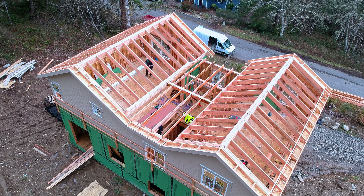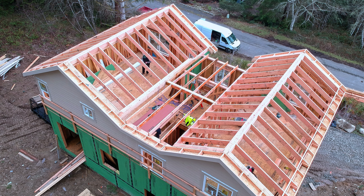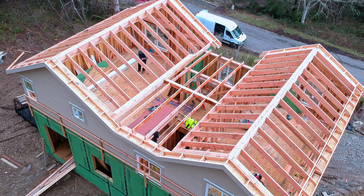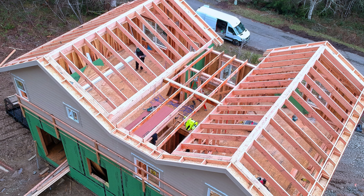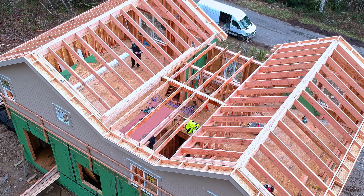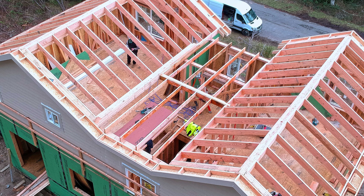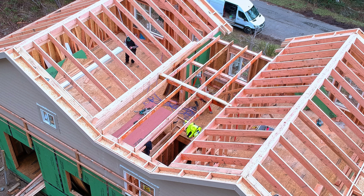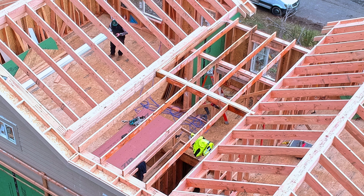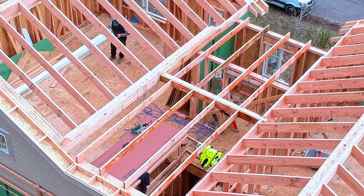This particular house plan has two 7/12 gables front to back and then a 6/12 gable you'll see momentarily. There's that 42-foot rake wall — siding, windows — all we had to do is take guardrails down later. Having the gables up there also makes it safer when you're on a ladder. It's a bummer that it's three stories up on the front side, but it was a really small roof so once we got into a rhythm it went pretty fast. There's the glulam that I mentioned before — it's strapped to a shear wall and runs all the way back where Kyle was cutting out the plates at the beginning of the video. You can see all the rafters land on that, and then you get a little bit of hardware later.